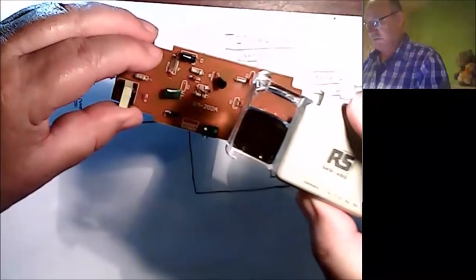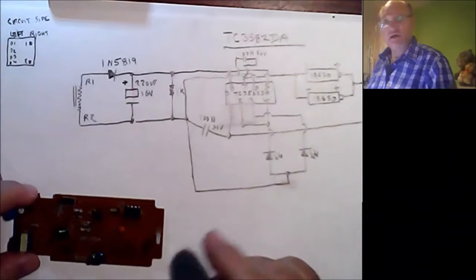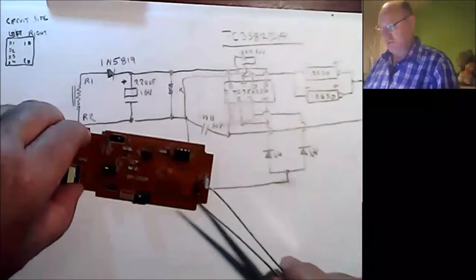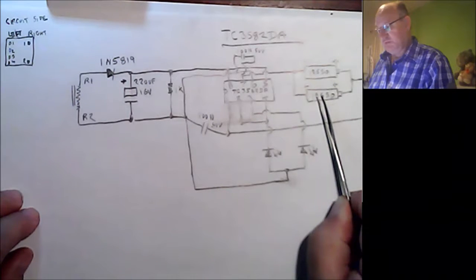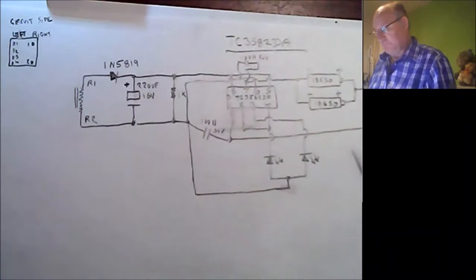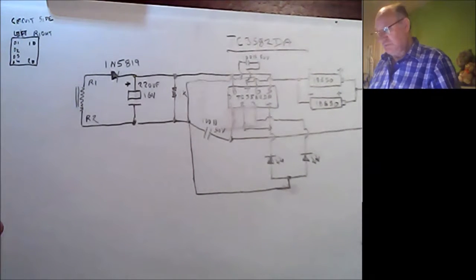It's definitely a TC3582DA. So there you go. And you can look that up and find that on the internet. It's just for the switching to say what mode you're in when it's charged, discharged. It's just a charging chip, and charges it back down through. Positive comes this way, negatives that way, and through the chip. What can I say? Yeah, TC3582DA. I'd written it up there, but didn't see it. Duh. Never mind. And that's basically it, the circuit.